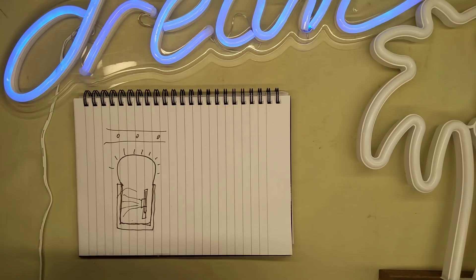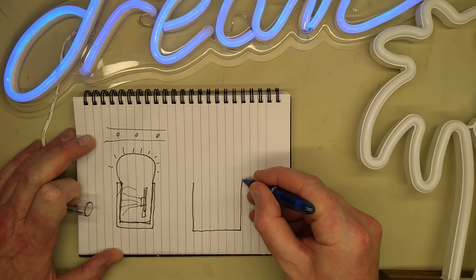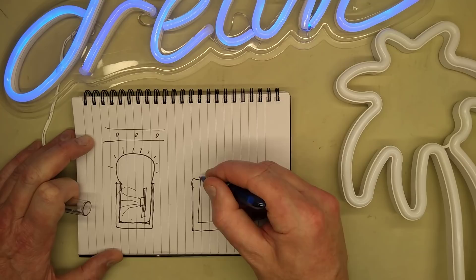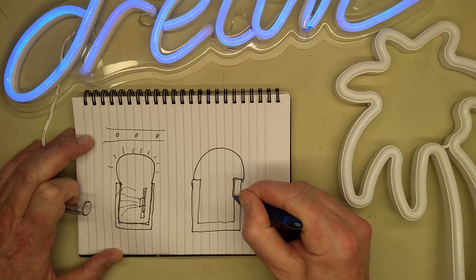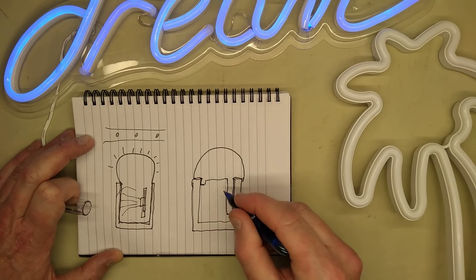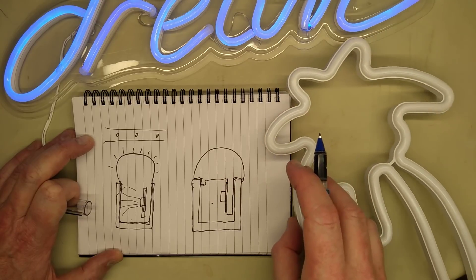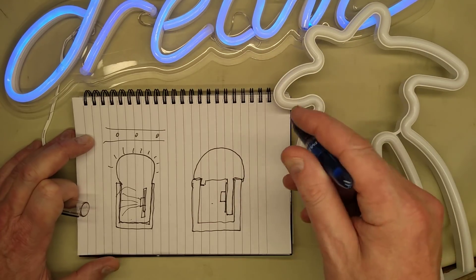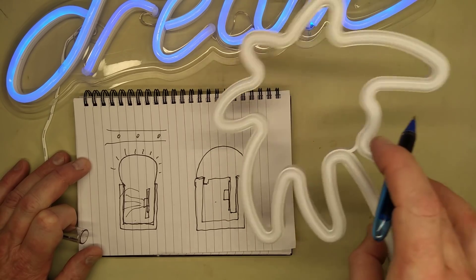Now with the light back, it's a very neat design. This one has a shaped plastic channel moulded in hard plastic. There's a hard backing channel forming the entire outline of the sign, plus another rigid plastic channel that domes over the front. Inside, a strip comes down just enough to go into the channel, and the LED tape is simply stuck onto the side with LEDs pointing sideways — giving the same effect, but with no complex shaping of the rope. It makes it cheaper — they can just run the LED tape around the shape and physically clip the plastic in. A very neat way of making a mass-produced sign.